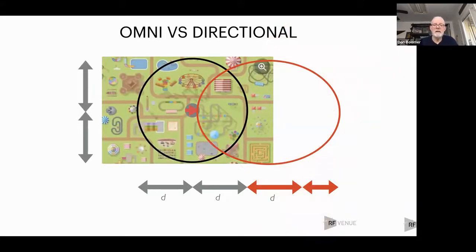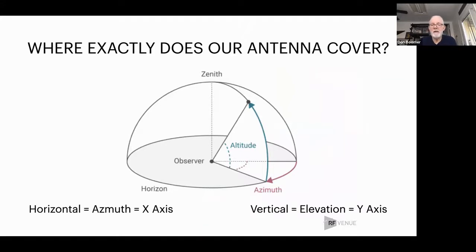On the other hand, if you're set up in a park — with a car show in one corner, kiddie rides in another, and entertainment in another — using an omnidirectional from the center will cover everything. A directional antenna would only cover the direction you're pointing it. Think about what you want to do. If you're just covering people on a stage, anything else you pick up is just adding to the noise floor. An omni pointed at the stage picks up everything behind it too, while a directional antenna is somewhat immune to noise from its backside.